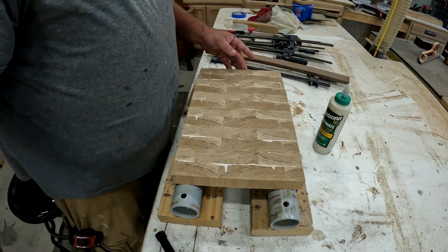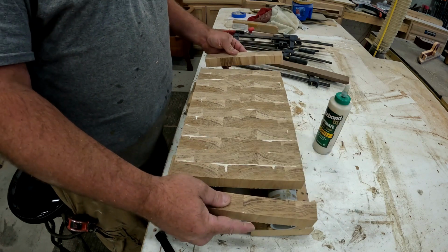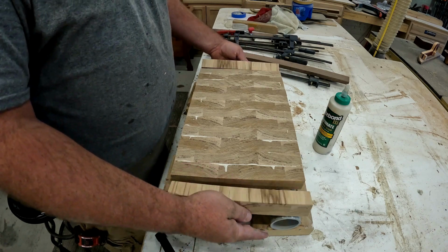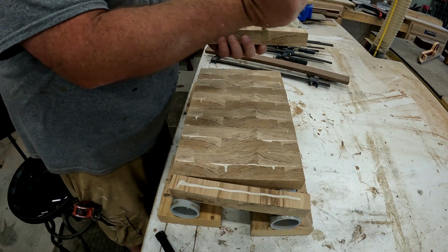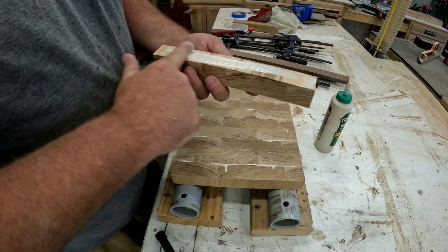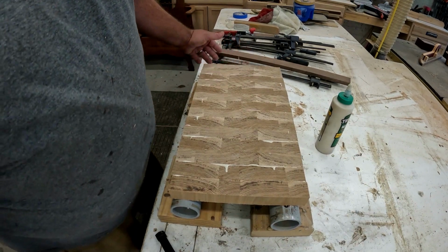And I'm actually going to use two extra pieces of the glue up from the same piece here. I'm going to put these on just to show you what happens when that runs through the planer, obviously they're going to get cut back off. So let's go ahead and glue these on too while we're at it. And these will just be sacrificial. Okay, let's go ahead and throw this in some clamps and we'll set it aside to dry.